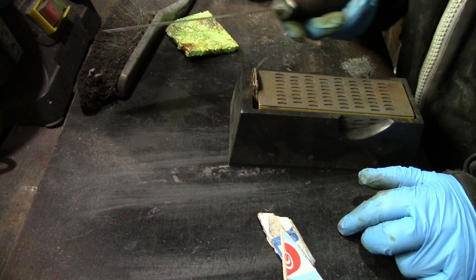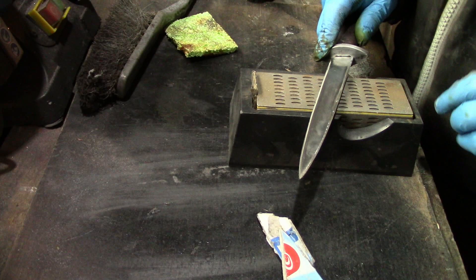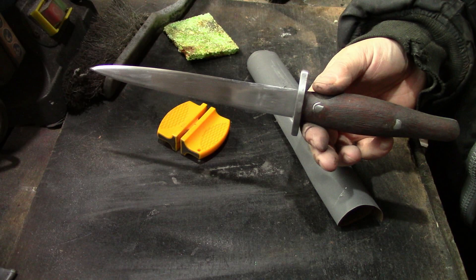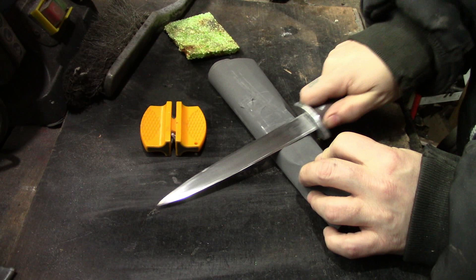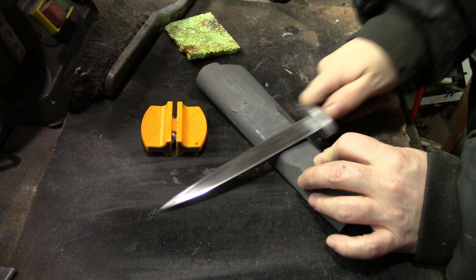If you're ever doing double-edged blades, make sure you're very careful because your fingers are pushing on a blade essentially. So as soon as this starts to get a little bit sharp, I'm going to put some leather gloves or cut-resistance gloves on. I've put an edge on this now — it's not that sharp, but I never make mine razor sharp. I'm going to try and tidy up the blade now, just going over various sandpapers, going to a finer grit as you go.